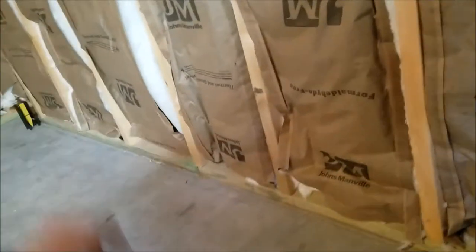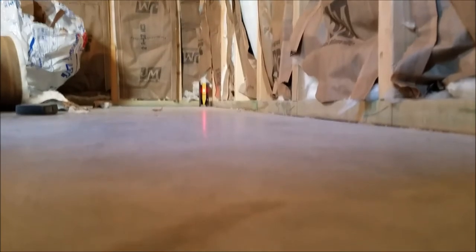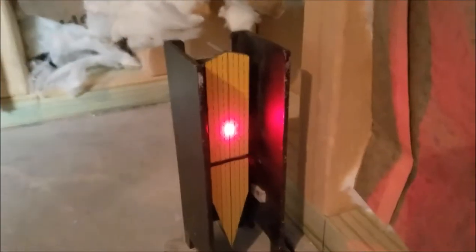Okay, what I'm doing next — hopefully this wall is square, I don't know, it was already here — it's the wood one that has really crowned-out studs. I put a mark at two inches down at that end and a mark here on the floor at two inches. Now I'm going to turn my laser on and shine it on the floor there. My target down there at the other end — I'm going to try to line that up to that two-inch mark. Sometimes if it's not perfect you can tap your laser with a pencil, just to tap it this way or that way. And it seems to be right in the center of my mark on the floor, so we're good.